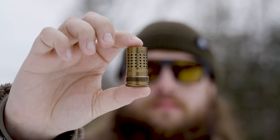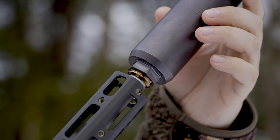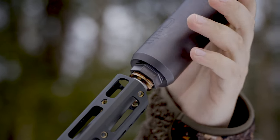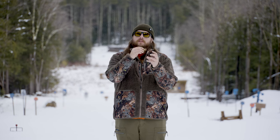A point of contention a lot of people talk about is why no wrench flats on the back. Well, we do have a wrench feature on the front — it's for a socket. We also tell you how to utilize it. If you torque this onto your barrel like we ask you to, and then hand tighten your silencer, there should be no reason for it to get stuck. It's sealed off — you're not going to get carbon lock. The tapers also make it so you need 20% more torque to remove the can than you do to put it on. So if you just hand tighten it onto something that's already torqued down, you shouldn't have any need to put a wrench on there.